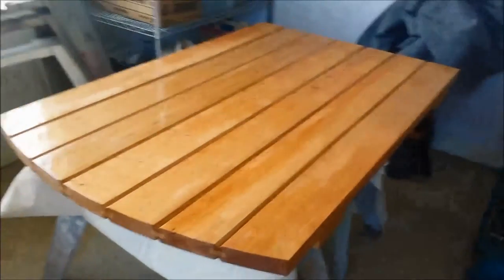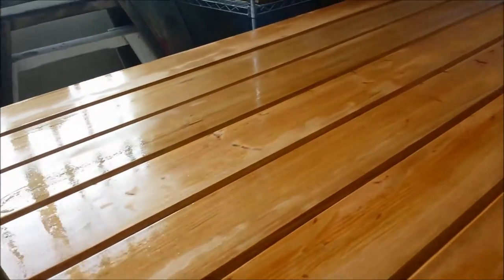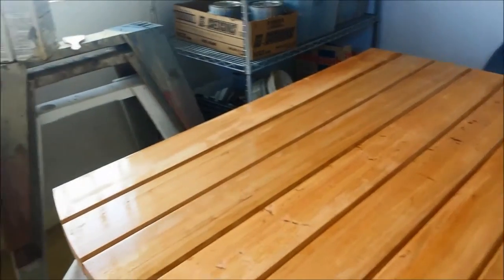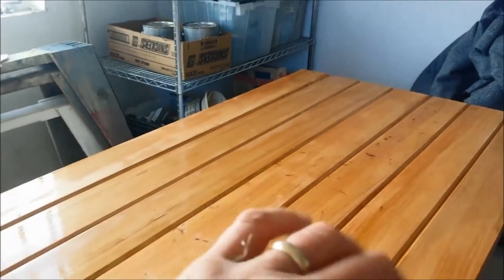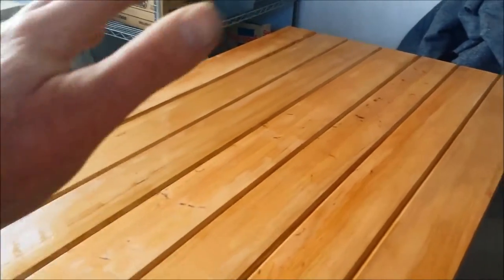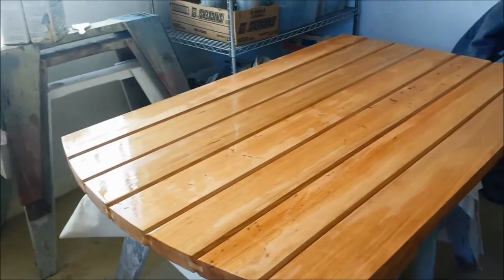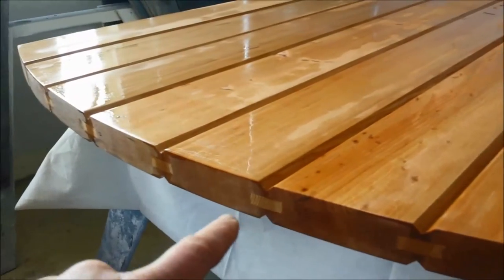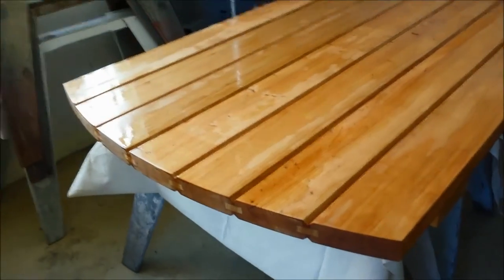Here's the door fully coated. I flood coated the front and as you can see it's still quite wet, but this is a slow-drying, watery epoxy so that over time all of this is going to soak into the fibers of the wood and make it basically plasticized. This is a good coating to put under something you're going to varnish, and also a good coating under things you're going to paint. See how the end grain really sucked the material up — so water cannot get sucked into this wood over the years and cause rot.